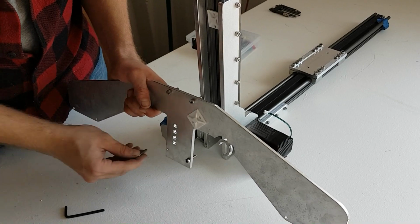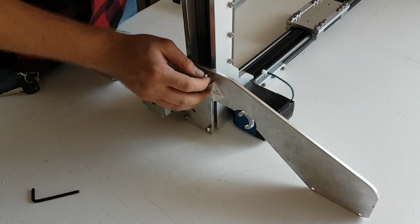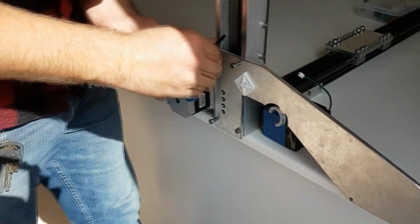It's important to not tighten the screws all in a clockwise pattern. You should do crisscrossing patterns in the corners first, rather than tightening one down all the way, then tightening the second one. You should do them across from each other.